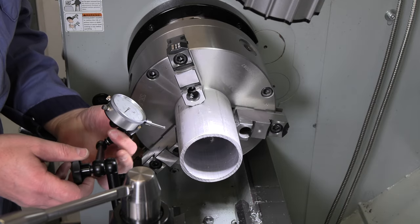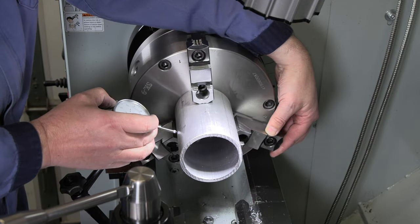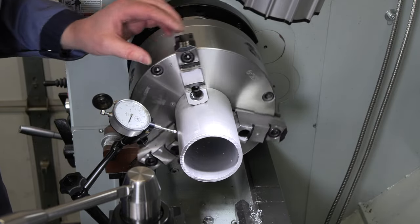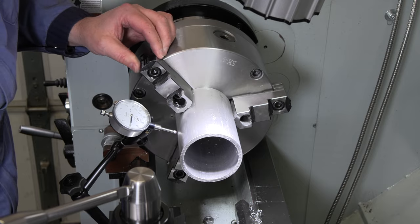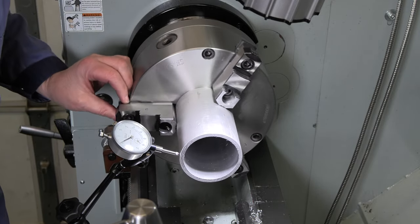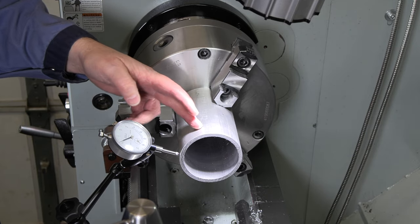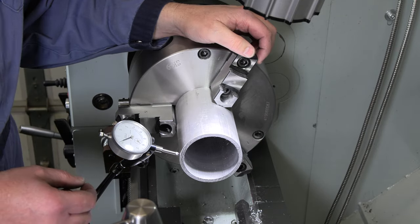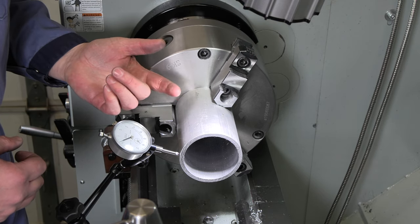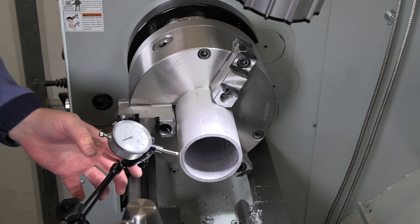Turn that a little bit so it's... So we've got a good 20 thou run out. I just want to see how that compares. Yeah, it would appear. All right, so I'm getting the same run out at the chuck as out here. So it's not in there crooked, it's just a little bit out of round. That's just how pipe is. So if I've got 20 thou difference, that's gonna be potentially almost 40 thou off the diameter